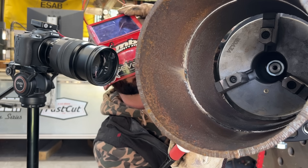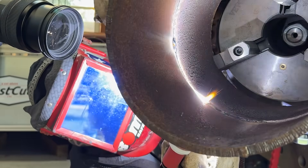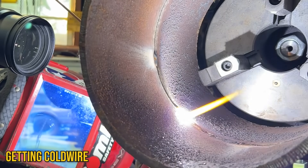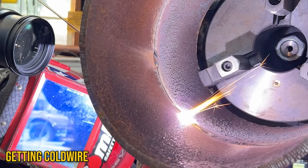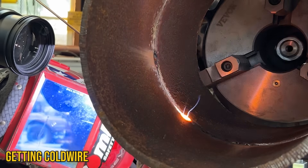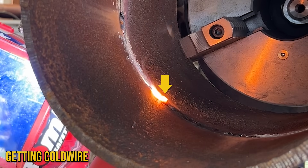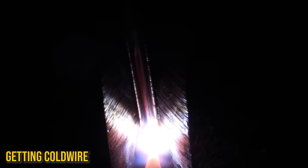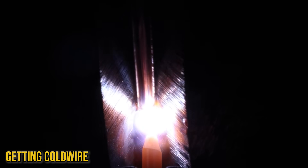The next thing we're going to try is cold wire. Typically this is going to happen when you have tighter bevels and you're trying to feed this wire in. If you just get a little carried away with shoving wire because you think you're key-holing and need to feed into it, you're going to get either an excessive spot or a cold wire right there. You really shouldn't feel yourself shoving any wire — you can apply pressure, but you shouldn't shove unless your gap is really getting tight.